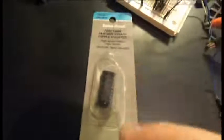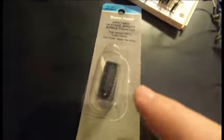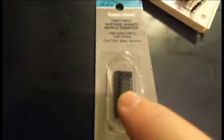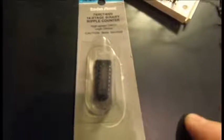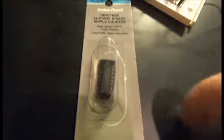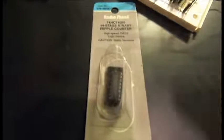They're pretty cool. You just send in a signal, and then a bunch of these output pins are counting that digit in binary. So if you send it a clock signal, you're getting a clock divider here. There is the slight complication that this is triggering on high to low, when most of the, a drum sequencer or something is going to trigger on low to high.